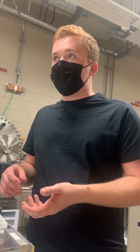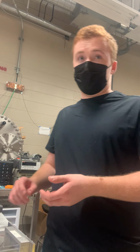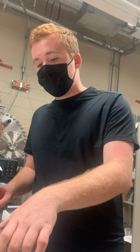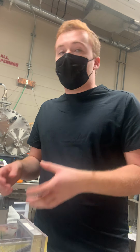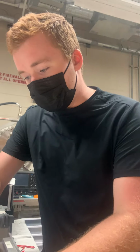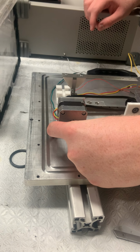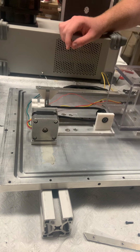There's a certain standard called GD&T, Geometric Dimensioning and Tolerancing. It's a standard set by ASME, the American Society of Mechanical Engineers, and using those standards, I'm able to come up with these drawings that I can send to the machine shop, which will allow them to know exactly what I want to build. Because if you're not entirely specific about what this dimension is from here to here, this little outcropping might be here instead of up top. We just need to be very specific with that.